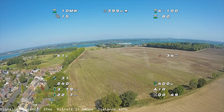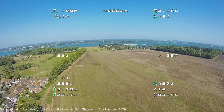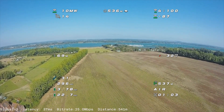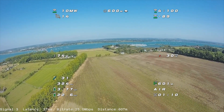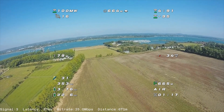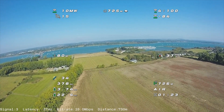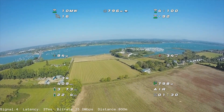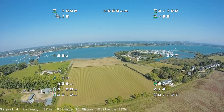I was saying about how I wasn't convinced about the dual-band antennas on the Nomad module, but on this particular one I can actually see the amount of power we're putting out, and it's 10 milliwatts all the way out there, so it's clearly not a problem with the dual-band antennas. I just need to sort out the receivers on those two other quads. We're starting to get to the business end now, so I'm keeping an eye on that signal down on the left-hand side, which goes up to a maximum of four. I would expect it to drop to about three, and I think previously using the direct UFL antenna it only dropped to three and didn't go to two at all, but on this occasion I do notice it drops down further.